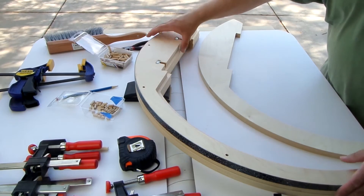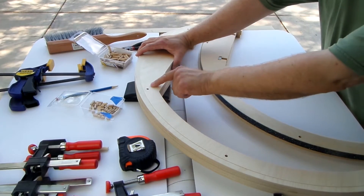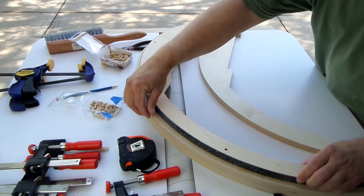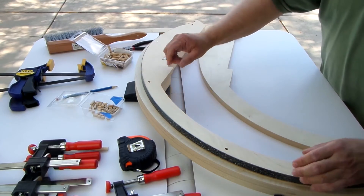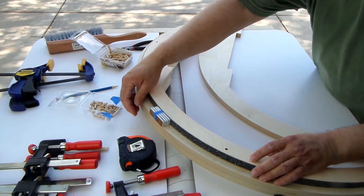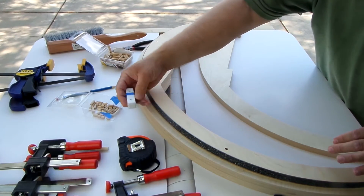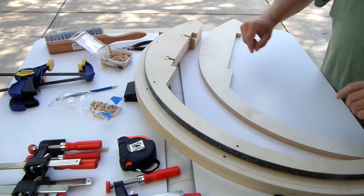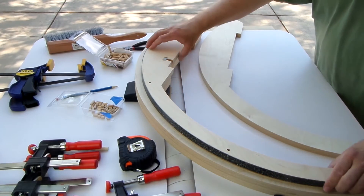The third layer is a little bit different. You'll notice that this piece with the laminate on it is thinner — it's a half-inch thinner than the piece underneath it. The reason for that is that our Teflon runs on supports — little pieces of Teflon — and the whole support goes up in there, keeping the telescope in alignment and giving it good motion. This piece is thinner than the surrounding pieces to give the proper capture and motion of the system. The way it's built, you can just lift the whole assembly straight up off the supports for storage or transport.